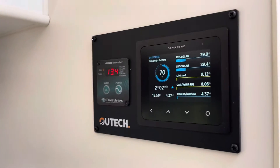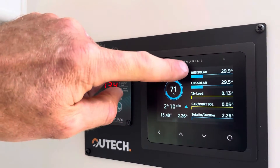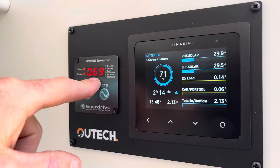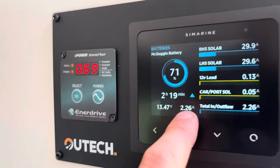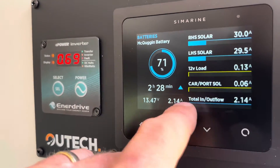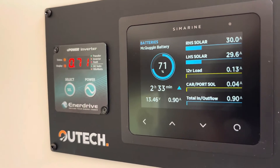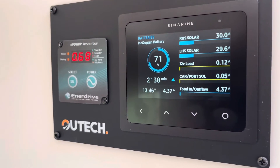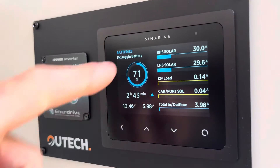I've just switched the air conditioner on. Previously our total inflow and outflow was sitting at around 58 amps in the blue. As you can see our solar hasn't changed — it's still just under 30 amps. Over here we've got 700 watts of usage, so the air conditioner is using 700 watts. But the key point here is that we still have charge going into the battery even though we're running the air conditioner — a total inflow of nearly two or three amps. So we're collecting more solar energy than we are consuming. This will actually improve throughout the day — potentially upwards of 35 amps per channel.